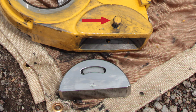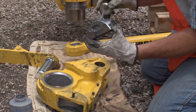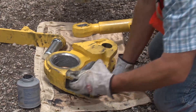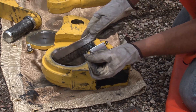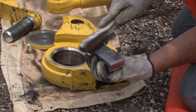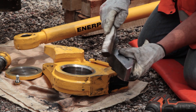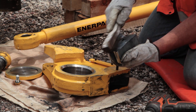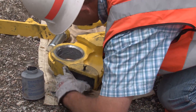Next, we'll work on the rail jaws. Begin by removing the socket head cap screw securing the jaw to the swing arm — the screw is located on the bottom side. Remove the jaws from the swing arm pocket. Thoroughly clean the swing arm pocket of all corrosion, contamination, and debris, then put anti-seize compound inside the pocket area. Inspect the jaws for wear or damage and replace all four jaws if required. Clean the jaw surface using a stiff wire brush or file card. Do not put any lubrication or anti-seize on the jaw teeth. Jaws and rail both need to be clean and free of any debris, paint, grease, or raised letters. Replace jaws before they reach a point that allows slipping. Apply anti-seize to movement surfaces. Once all surfaces are cleaned and anti-seize is applied, reinstall the jaws.